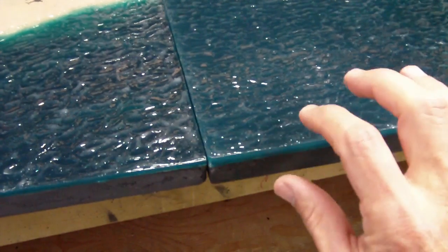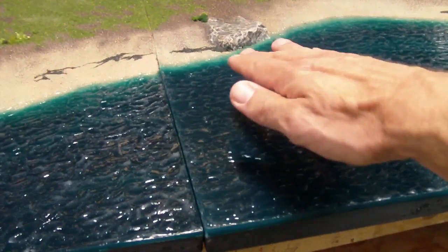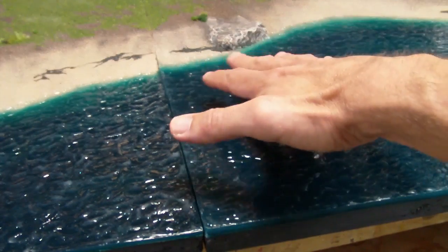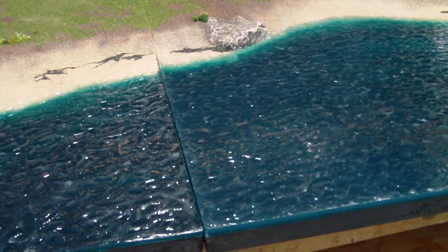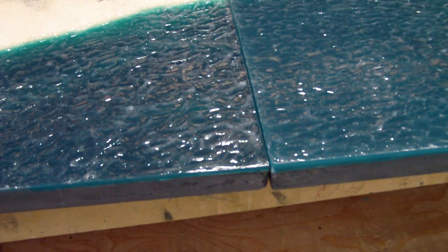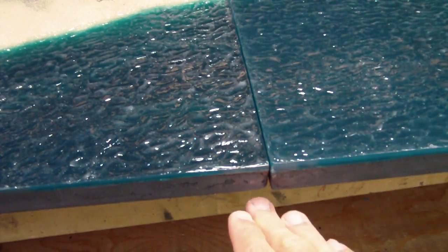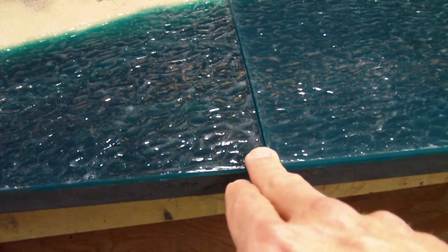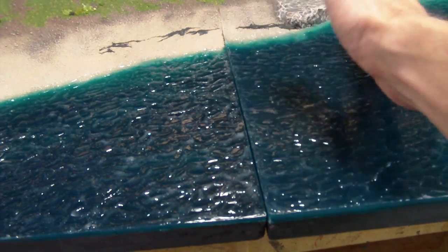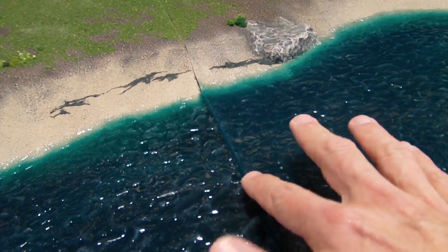From a profile, you can see the amount of resin I poured for these water boards is much lower than what I had done previously. I was still able to get a good visual transition by bringing out some of the brights a little deeper into the water area so they fade out further despite the thinner layer — a nice compromise that also saved on materials and weight. When I carve the boards using the 3D scroll table with a big blade, depending on their warping they may have a slightly different depth. I tried to pour the ocean water to the same depth by lining them up next to each other and observing their unions, but this one ended up about an eighth of an inch higher.